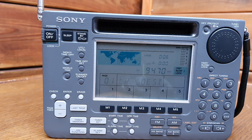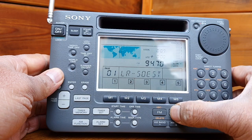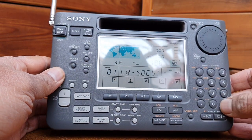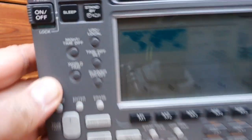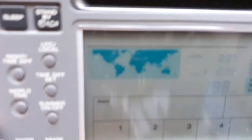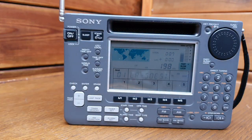If you're handy you can do it yourself, or take it to a radio technician. This is one of the symptoms I showed you. On AM at 198 kHz you can see it is able to tune the station but the audio is so weak. I'll put details in the schematic diagram in the description and in the links so you can see which capacitors and what ratings to use.